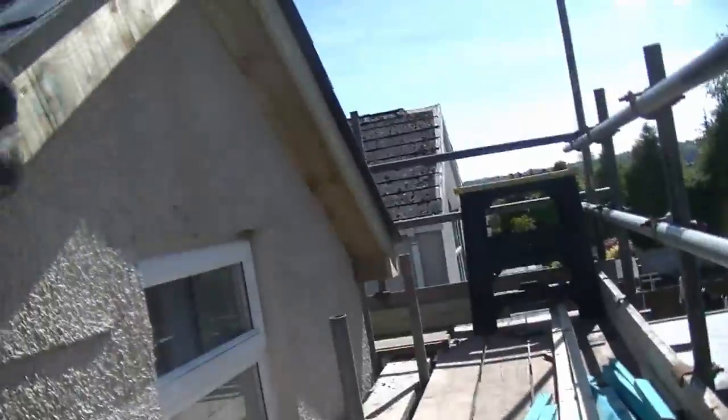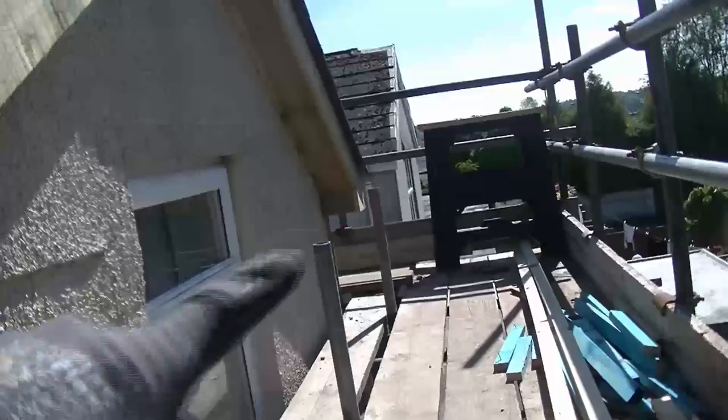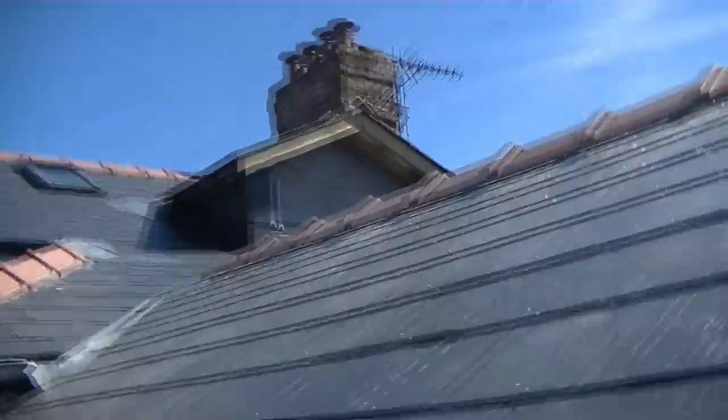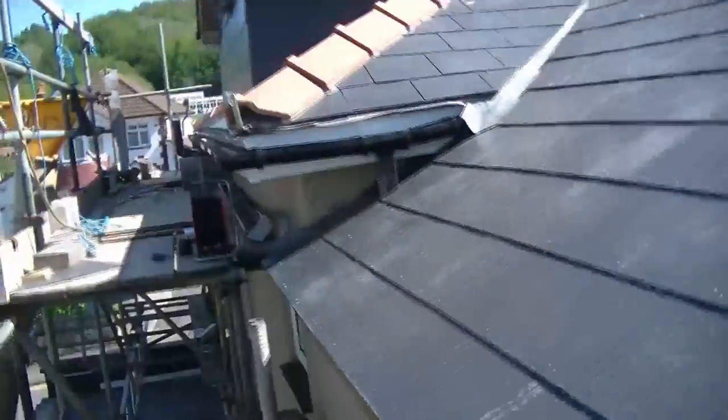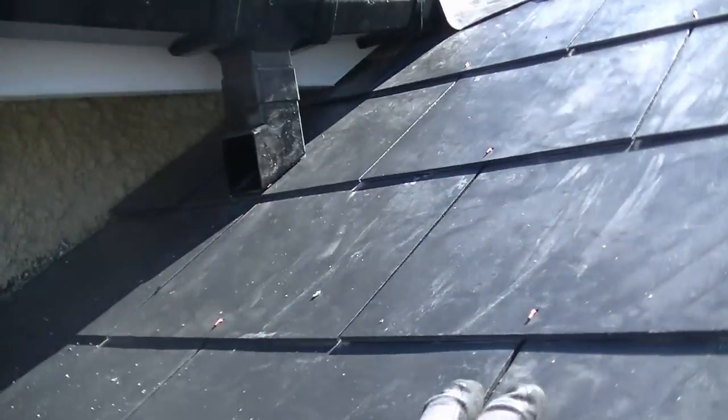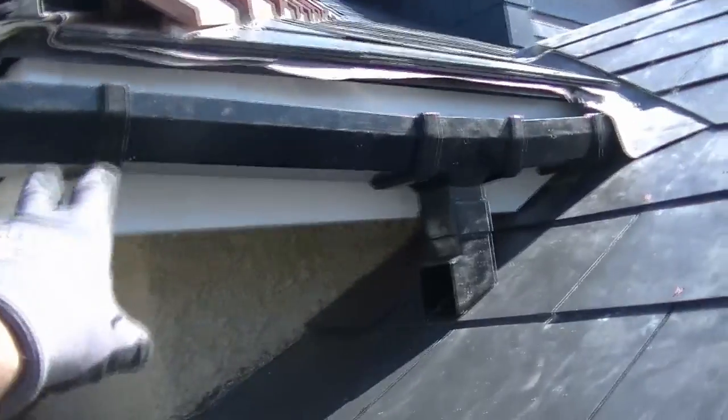Just to give you a quick overview of what we've been doing today - we've put in the soffit board on here, done the same on this one going up there. We've got that one there done as well along there, and also I've been putting these box ends on there down the bottom just so it matches in with the house over there. I'm going to do exactly the same on the dormer there so it matches up. And if you come over here you can see I've just been finishing off this bit of fascia board which I couldn't do until this roof here was slated.